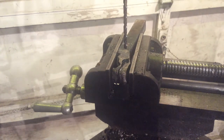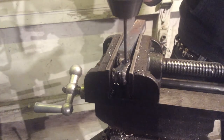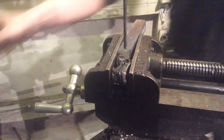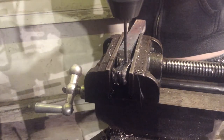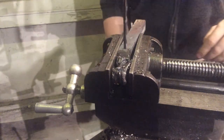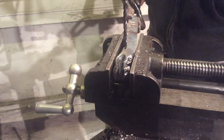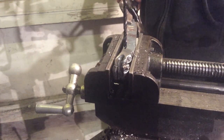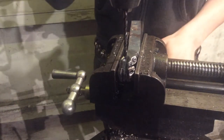So now we're going to drill halfway through the jawline, then clamp it and re-drill from the other side to see where they meet. Got everything lined up here — a little more lubricant. With the forged material, you're going to want to be liberal with the lubricant to make sure your material is cooled down. Because of all the forging, it's going to form weird carbides that can wear your drill bit pretty quick. Keep checking in to make sure your drill bit is cold and centered. Don't rush it with forged pieces because they have shapes that can grab your drill bit and break it.